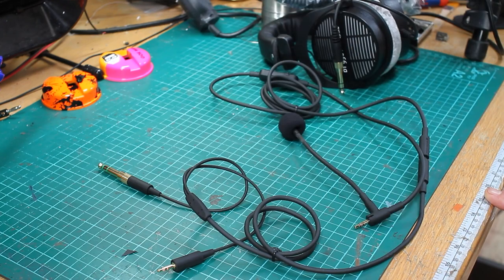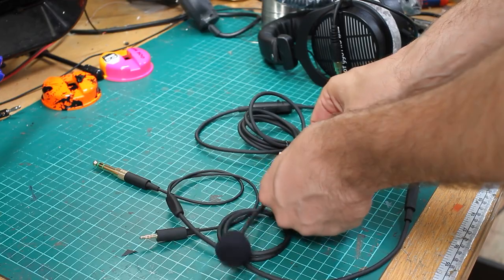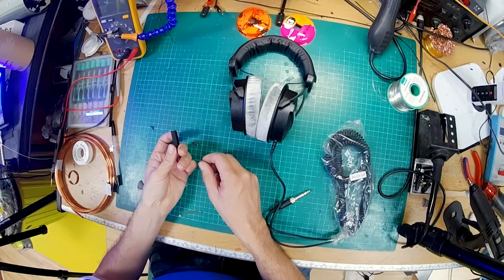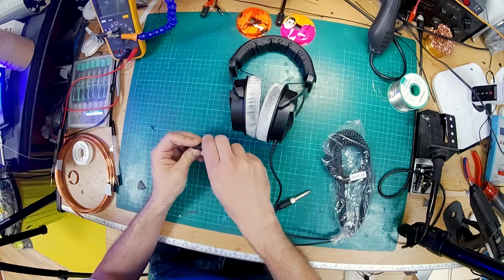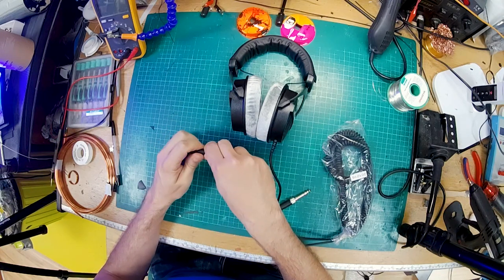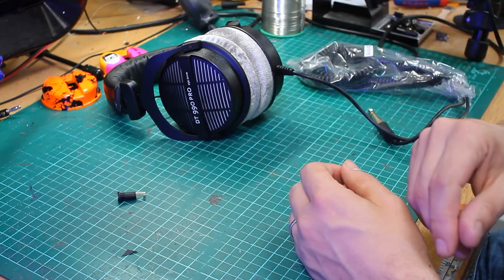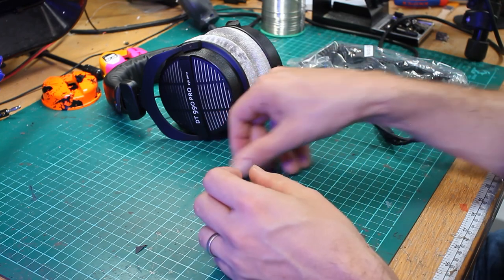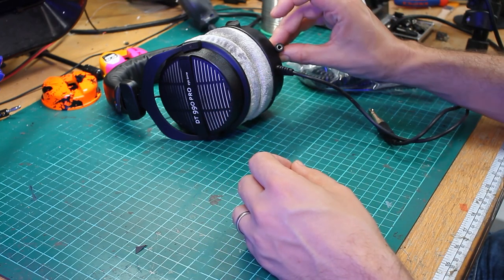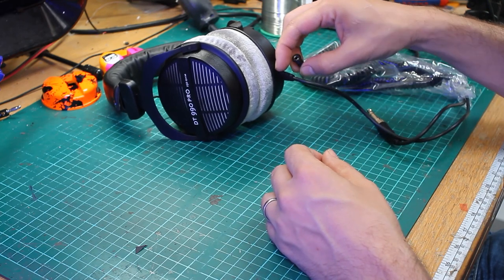Let's conjoin these things. So we've got a pretty standard 3.5mm jack here. This one's in an inline housing, but we're just going to use the core of it — you can buy them just like this. This one's a Japanese-made one; they're normally quite high quality. I've chosen black so it matches the body. That's going to go in that hole, and we're going to have to embiggen this hole slightly, so we'll use a Dremel for that.